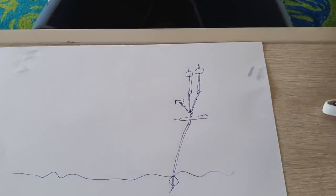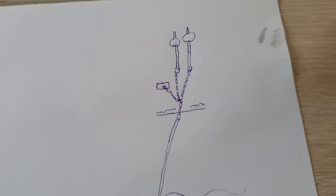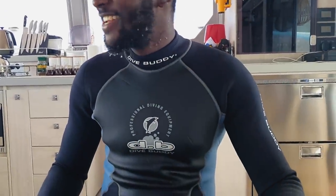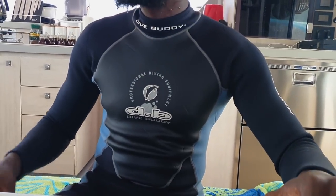How it's designed is, whenever the mooring gets weight, or there's a lot of gust or wind, and the boat pulls the mooring, the block will start lifting up, slow the speed of the boat down and bring it back down softly. But these boats are not that heavy, and there hasn't been any heavy winds lately. So none of the blocks has ever lifted off the ground so far, which means the moorings are doing their job. And he reckons our 23 tons is nothing. I think we're one of the heaviest boats in here at the moment. It's just pulling on the chain, but it's not lifting the block at all.